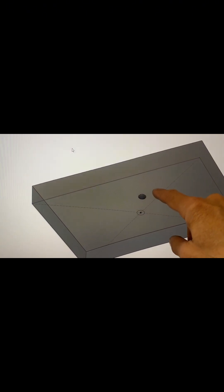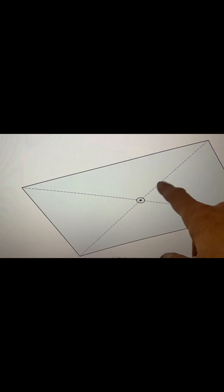On the XY center I put a hole — right in the center of the program I put it into design mode, so the hole is right on the center of the origin. I made it seven millimeters for a six-point-three millimeter pin, so slightly bigger so I don't have to be deadly accurate to center it. If it is off center and I go into the mold, it would just make a ring, so it wouldn't be terrible to look at even if I did mess up slightly.